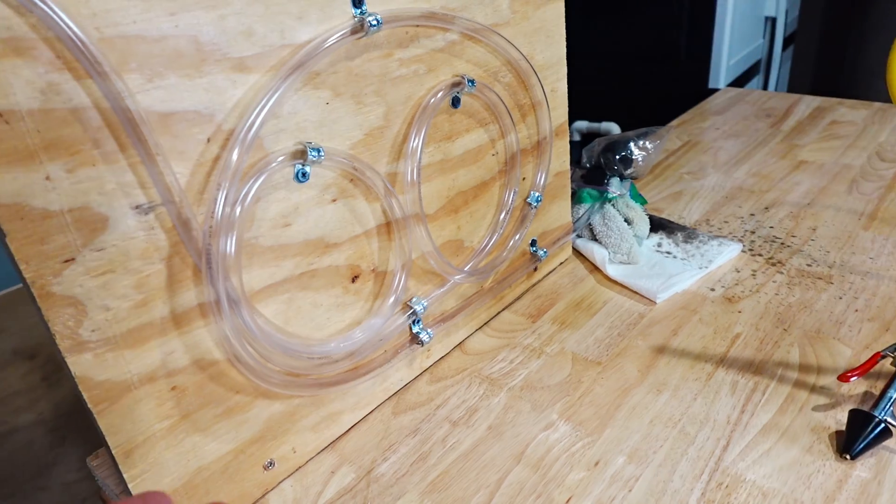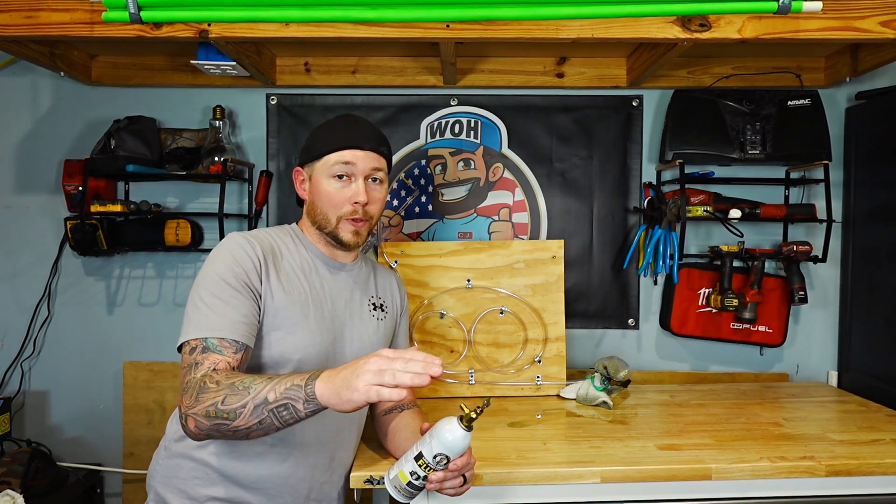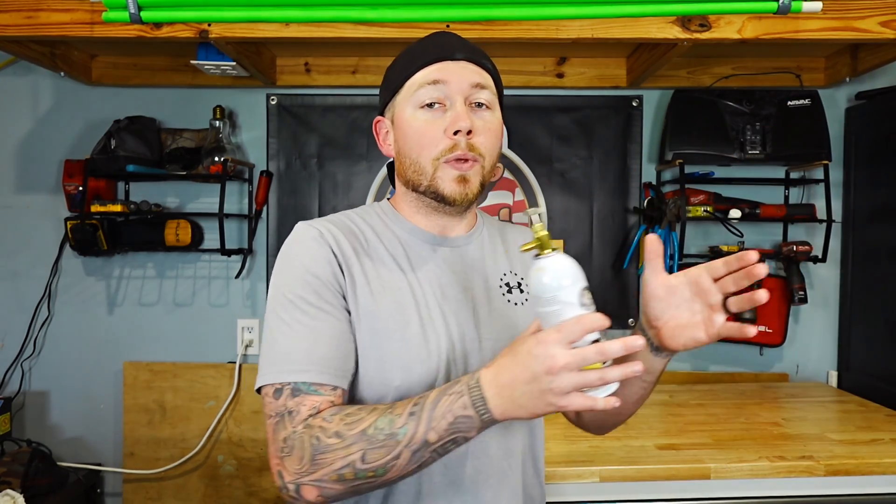If it pushes this kind of oil out of tubing, imagine what it could do to refrigerant oil. As far as the unrealistic line set test, the nitrogen failed miserably. It actually did take a blast of the HVAC guys flush kit in order to allow a second purge of nitrogen to flush the old oil out — because this will actually break down that old oil, turn it into enough of a liquid to where the nitrogen will flush it out. Anything that's leftover can get vacuumed out. Why would you want this? A burnout compressor — that's number one. It gets all that old oil out. Number two, if you're switching between refrigerants — say R22 to 410A or anything A2L coming out in the future — you need to make sure that oil somewhere in the line set, in an oil trap, gets out before you switch refrigerants, and nitrogen just doesn't cut it.